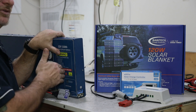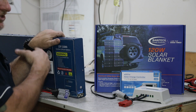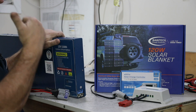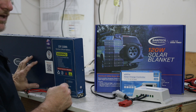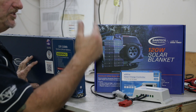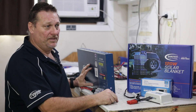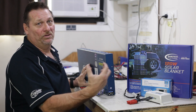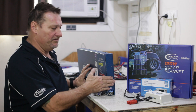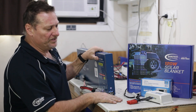It is on the input side — it's not actually going directly to the battery, it's going to the charger, and the charger is pulling the current through that. That's the other reason: the charger in here is a 20 amp charger. So if you're plugging in just a 120 watt solar blanket that's putting out 5 to 7 amps, it's going to try and pull all that through that circuit all the time, even though it's not designed to — because lithium will pull whatever you can throw at it. So it's not a good thing to do.